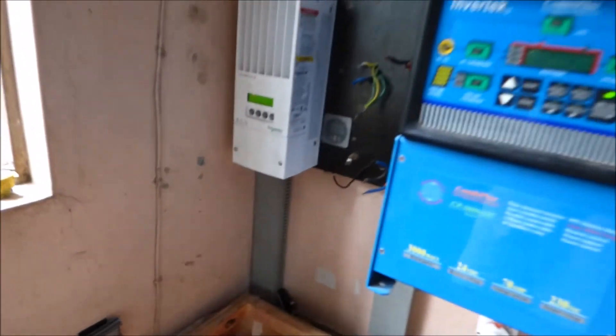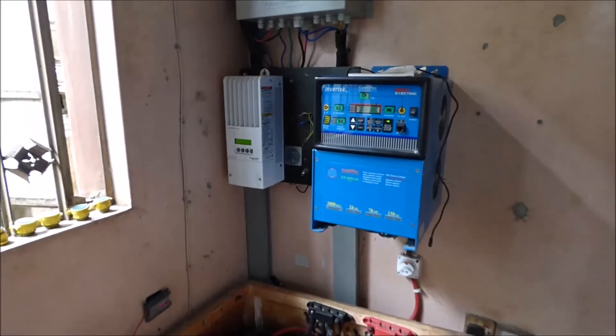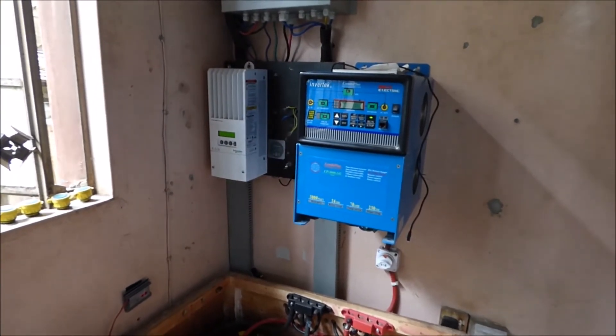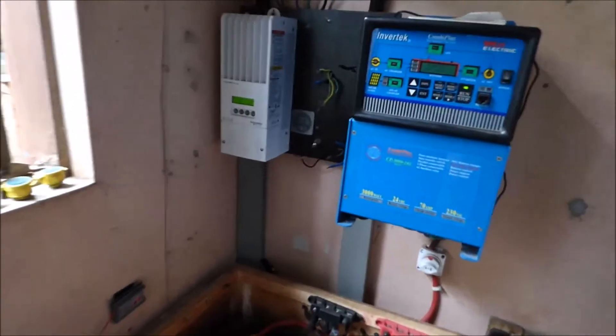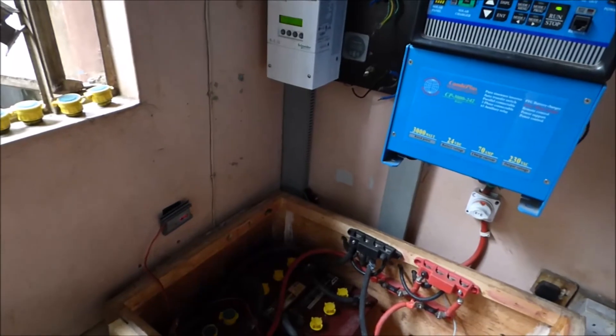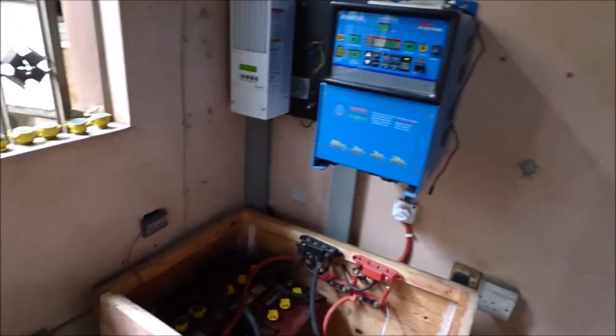So this does its job. The freezer is a very cold environment, so the controller assumes it's reading the temperature from the batteries, and it's going to increase the current to bring the batteries up to acceptable voltage. I've now removed it from the freezer and I'm going to put it back where it belongs in between the batteries.